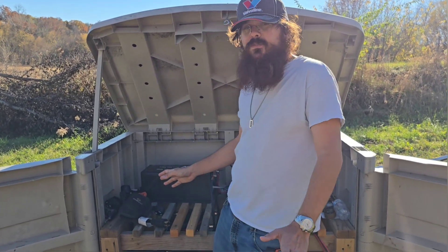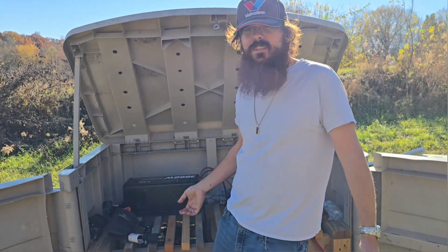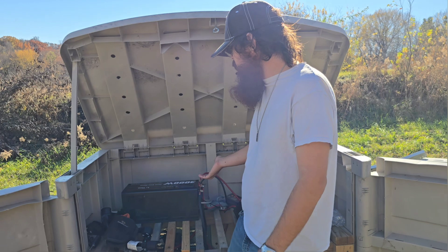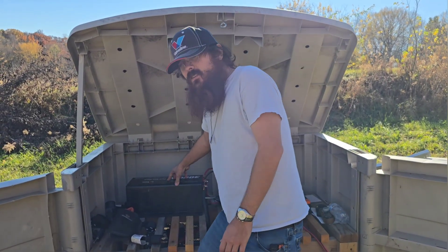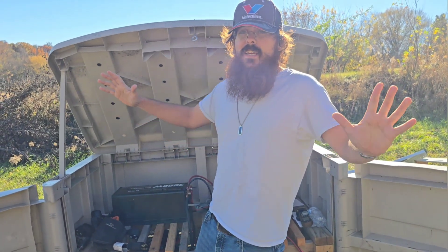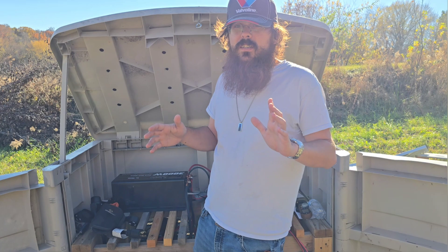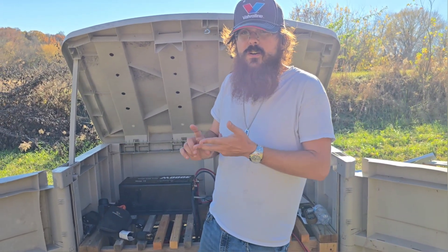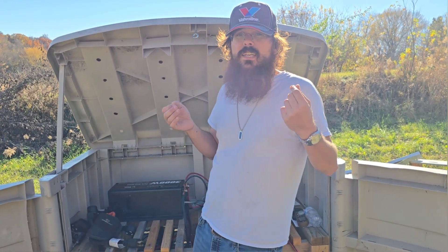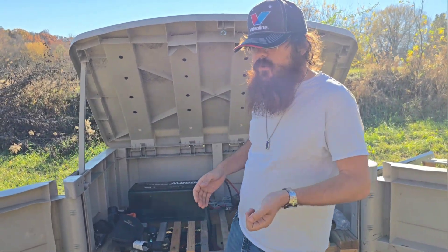It's very bad if you're living off-grid. When I hooked this up the first week, the batteries were going dead so much faster than they used to — they lasted a lot longer on that Harbor Freight inverter. Also, the efficiency is only 88%. That doesn't sound like a big deal until you're counting every single watt because you're off-grid with only 1200 watts of solar. That Harbor Freight inverter — the Jupiter pure sine wave — was 95% efficient.